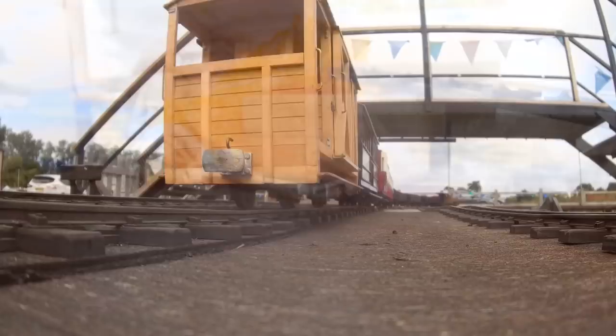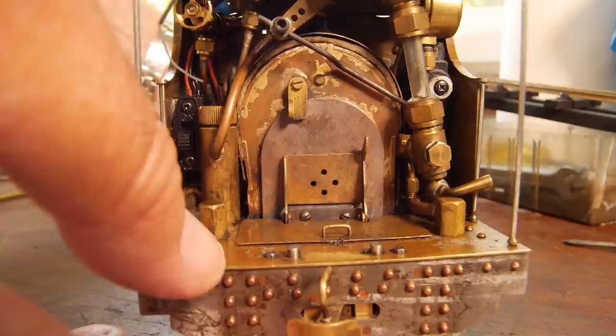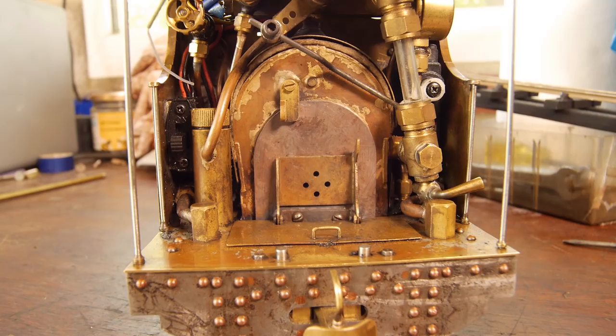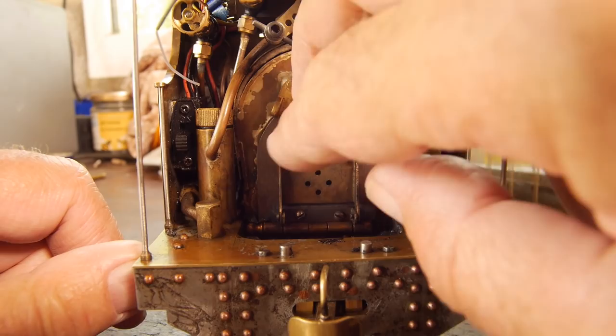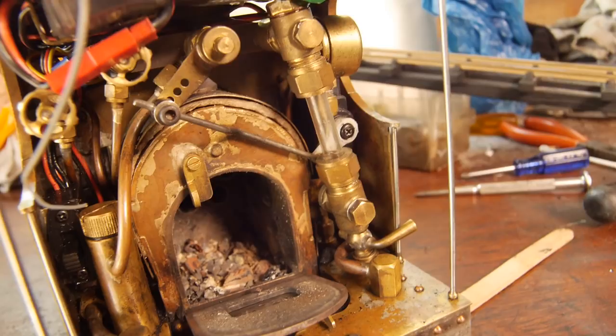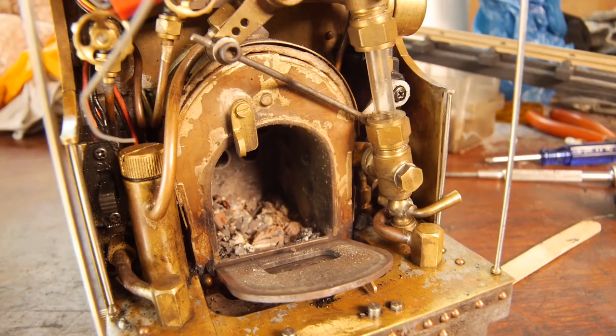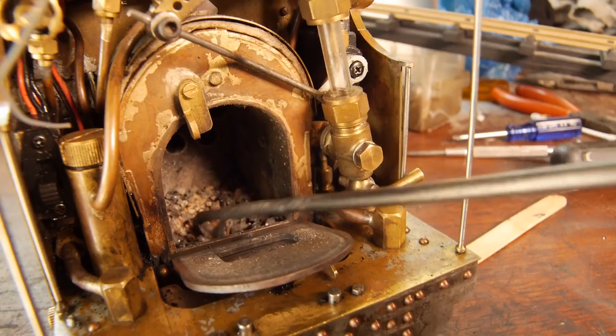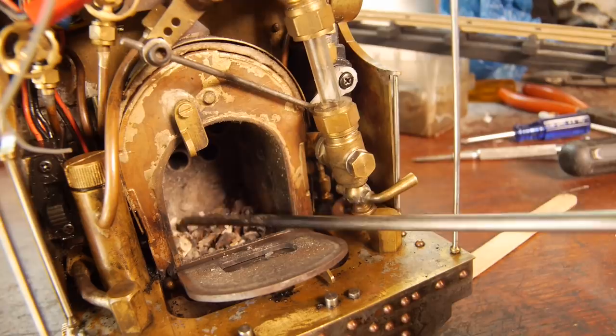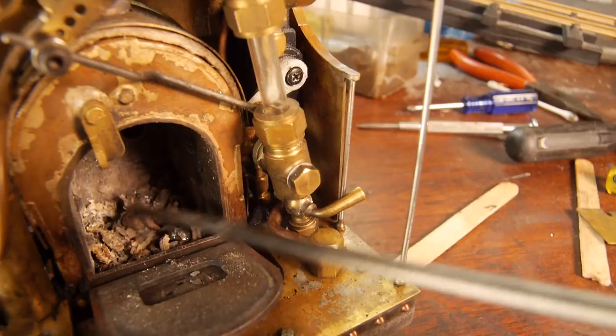Let's have a look at Russell's firebox now and see what's left there after about 45 minutes of steaming. The engine's cooled down and we can take a look inside and see what's left of the fire. It's not too dirty at all — the coal's burnt down well. Just a little bit in the bottom on the grate. It's not too bad at all. I'm quite pleased with the way the coal's burnt. I could have run it for a bit longer. There's no clinker, there's no clogging of the grate.